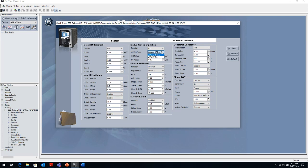Offline is basically if we're monitoring the generator breaker, when the breaker opens up, that's basically the generator going offline. So we can monitor the voltage and the breaker, and either one of those we can go into this protection, or if both. I should expect to see both when the generator is offline. I should expect to see the breaker open and the voltage bus de-energized, the generator bus de-energized.